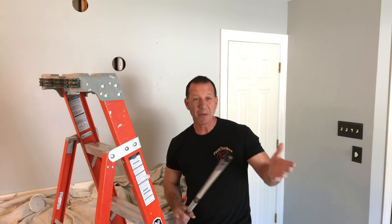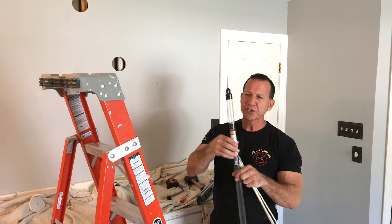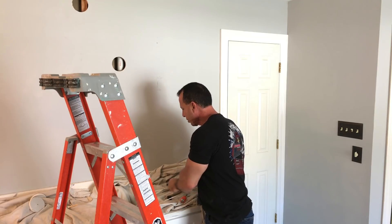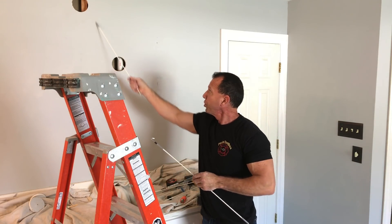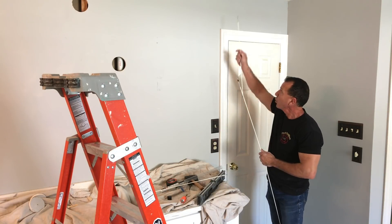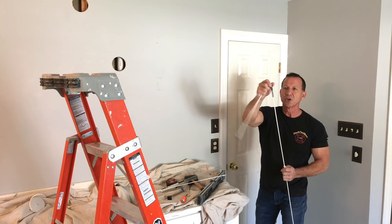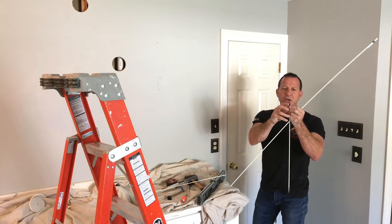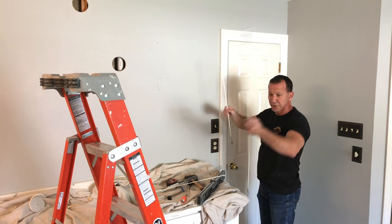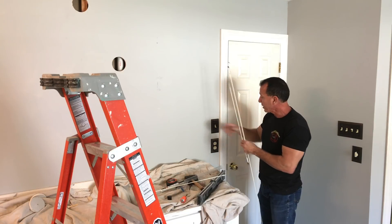I'm going to be using my fishing rod — and I'm not talking about sports fishing. This is for fishing wires through your wall. You can get these at any hardware store. It's kind of like a fishing pole: it's flexible and you can link them together. What you do is take one part, feed it through this hole up top, and run it through the next one. We'll put the wire on there and just pull it right back through. You can drill a hole right through your top plate, take your wire, tape it around the hook — or use the point right here. There's a little hole where you can take your wire and run it through and twist it. Then you feed it through using as many rods as you need, grab this line through the hole down here, and pull your Romex right through to hook up your box.